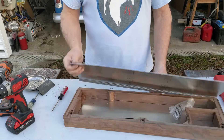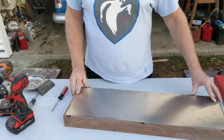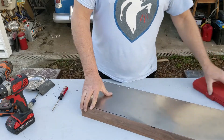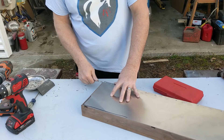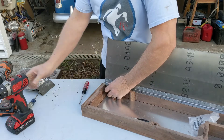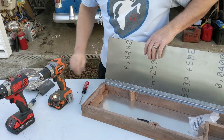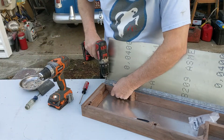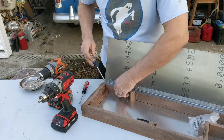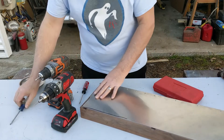I've got the hinge attached to the top cover. Now I'm going to attach the hinge to the wood frame. I'm going to get it centered in the recess I made for the hinge. I'll stick a screwdriver in here and push down on the bottom leaf, slowly opening it up. For now I'm just going to run a screw in there — later I'll go back and correct that bevel. I'm using number one square drive heads. Right now I just want to lock it down and make sure it's in the right spot.